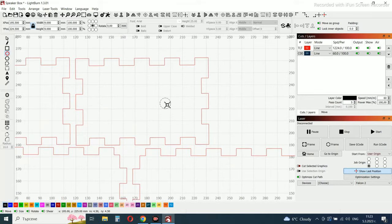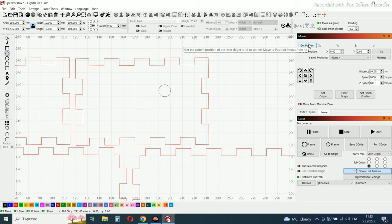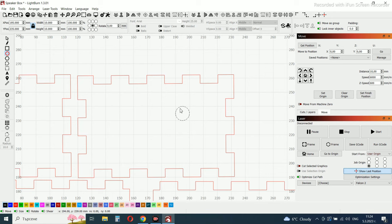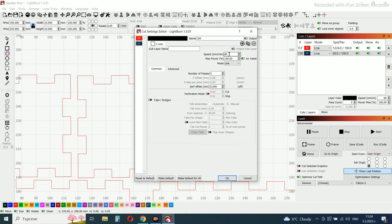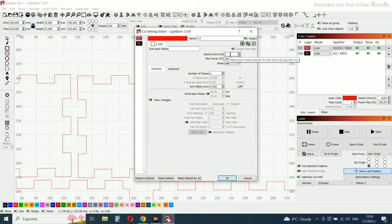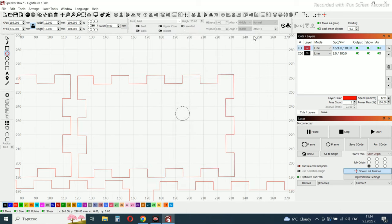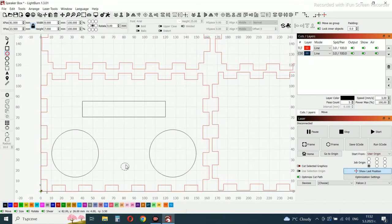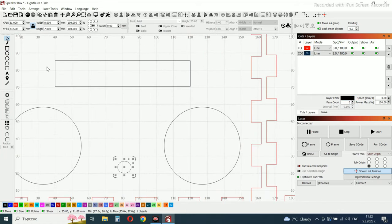For the DC connector hole, I will make a 1 centimeter hole. And for the hole in which I will insert the potentiometer for the sound, I will make a hole of 6 millimeters.